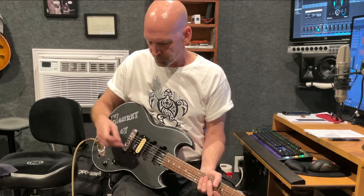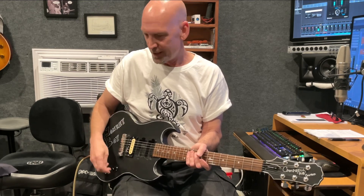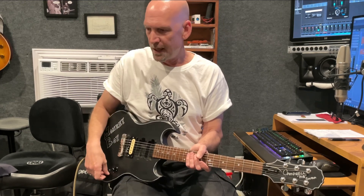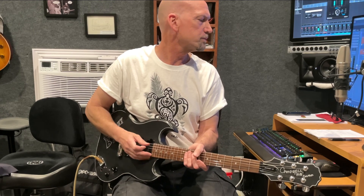What that's going to do is resist how much of the coil is being grounded. The 10k resistor is not going to let as much of the coils be grounded, so it's going to be louder. But it also won't hum quite as much, and it might be clearer — maybe more like a P90 or something like that. As we go to the lower rated resistors, the 6.8 and the 2.2, you'll notice the output drops but it gets a little more clear, more single coil-like.